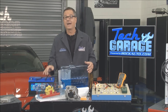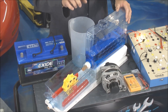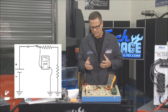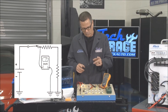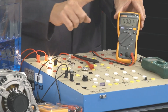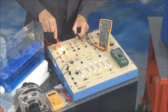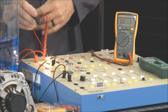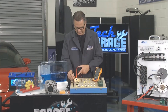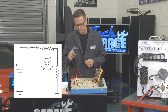You can see the pressure building up the more we add. You'll have to join us next week because I'm going to pull this plug and we'll talk about current and resistance. Now, voltage — take a look at this graphic. We can measure voltage a couple of ways. The first is voltage at a point. If I take my meter, set it to DC volts, I have a light bulb burning on this board. I touch right here at this point and then come over to ground — you can see I have 12.51 volts going to the light bulb.